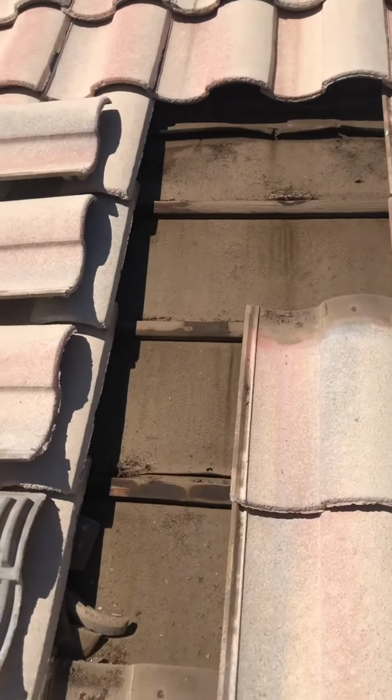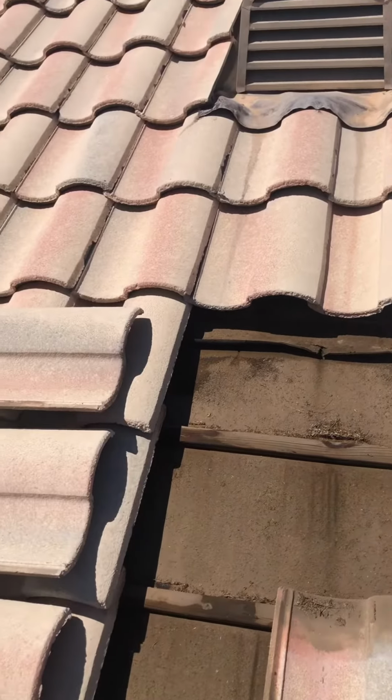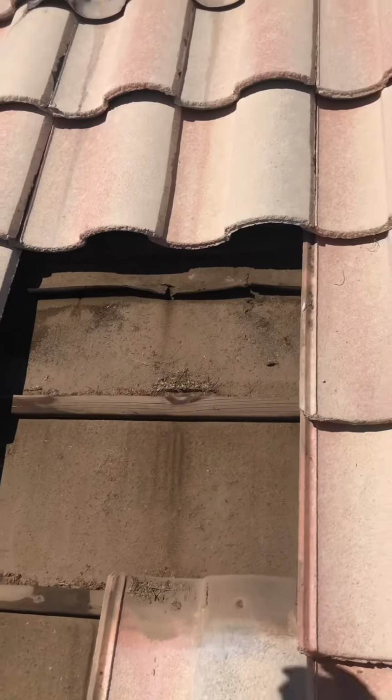And last, but certainly not least, is your southern facing slope. So this is approximately above where the leak is coming in. Look right there, there's your dormer vent coming straight down from it. We're checking out the underlayment. Here's the lower part of the underlayment starting to curl up. Those nail holes are starting to pop out, which is causing a problem.